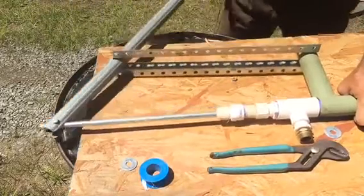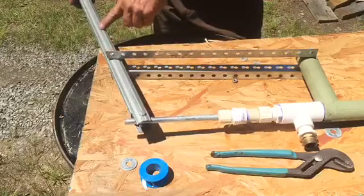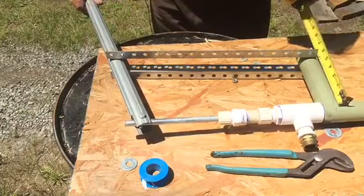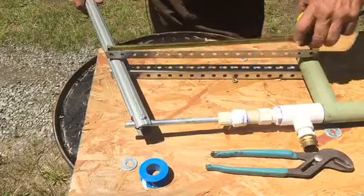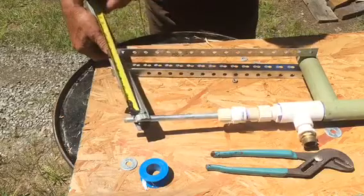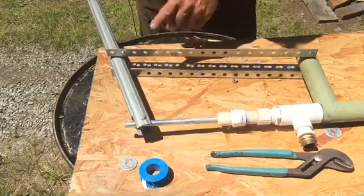You can make that longer depending on your pump by making these bars longer and moving this hole further out on the handle. Of course, when you do that, it's going to be a little bit harder to pump. Now, just for your basic measurements, from the center of the pipe out, this hole here is 6 inches out. This right now is working on a 17-inch bolt hole to bolt hole length. From this bolt hole over is 9 inches. Right now I've just used this ready metal with holes all in it. It's a whole lot easier to keep figuring out where you want your handle.